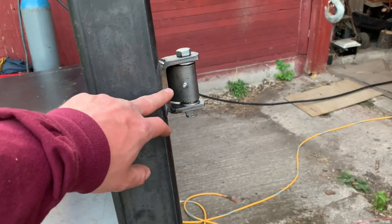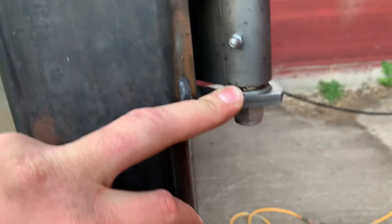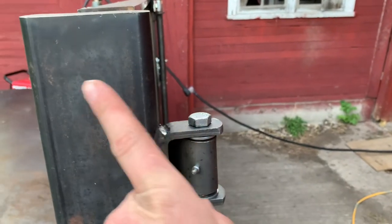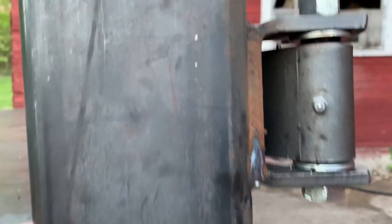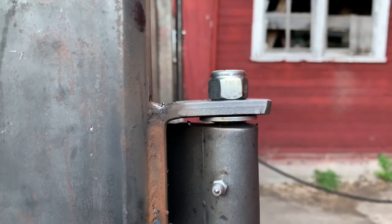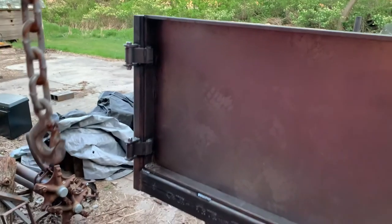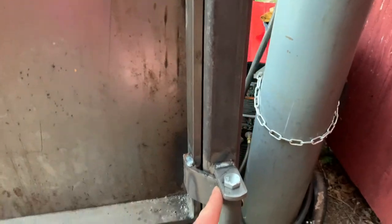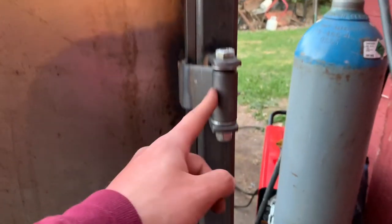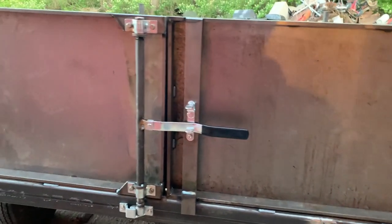If I can figure out how to put a link I will. I put bronze bushings in here - I'll put a link. They come with these plastic ones and they suck. I put the bronze bushing on the top on this side and this door turned out just great, it swings great. This other door has a bronze bushing hinge on the lower side and not the top, and it sags down really bad. I should have just done all of them - I don't know why I didn't, I was being lazy.